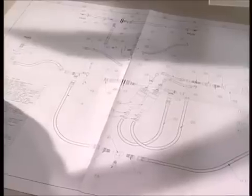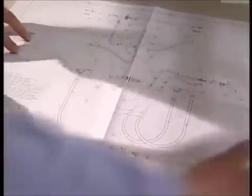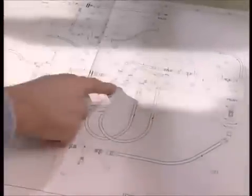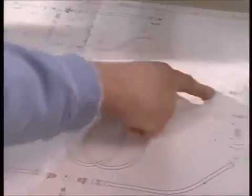A very quick explanation of how this fuel system is piped. You've got a fuel tank either side. The fuel comes down here, through this isolator, down here, around these pipes, through the fuel pumps — two fuel pumps — round here, through this, through the filter, and into the injectors. Have you got that? Good. Right, let's get on with it.